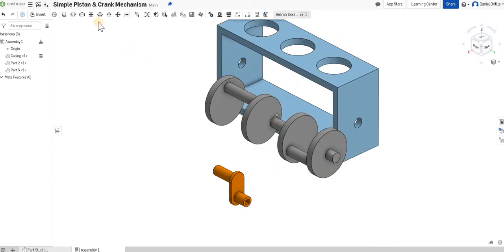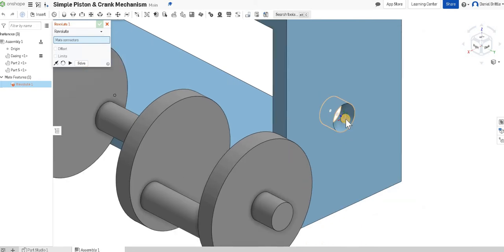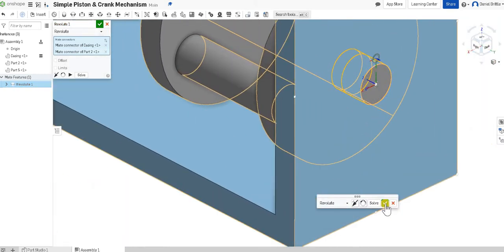We're going to use a cylindrical mate for that cylinder to go in — actually, I'm going to change my mind. A cylindrical mate would allow it to move left and right and rotate, but we don't want it to move left and right, so we're going to use the revolute mate instead. As I hover over the cylinder I can pick the left side, the center, or the right side — that's always important to remember and it does impact how you build parts. I'm going to click on the right-hand side, and that's going to marry up with the crank cylinder — selecting the right side there to match.